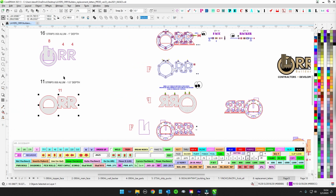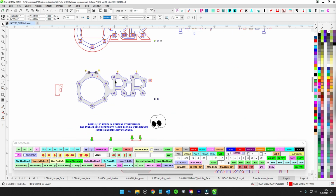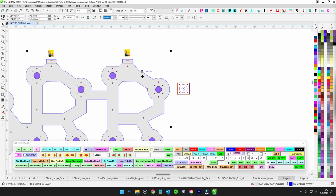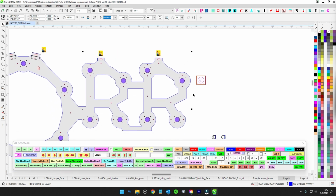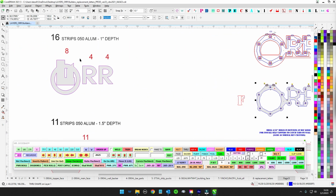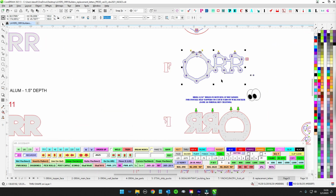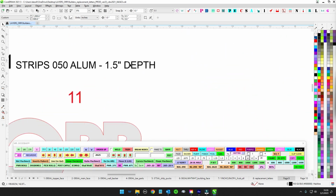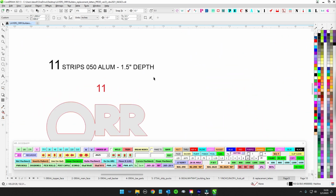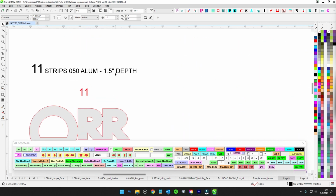On this one with the 1.5 inch return, this one's going to slide down on top of this one, and only the 090 backer is going to be the play that we have. Anything over 1.5 inches, if it's a little deeper than that, could scrape the paint on the wall or be difficult to get on. So make sure you're at 1.5 inches, because this whole thing is all about clearances. 1.5 inches is our max.